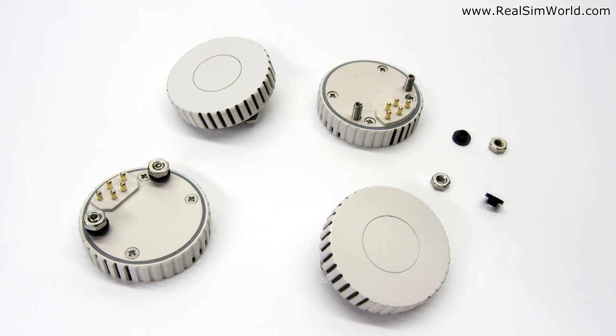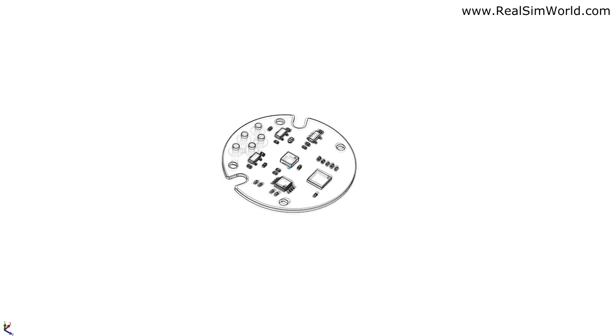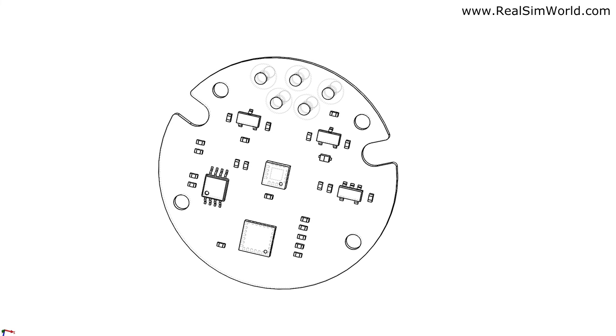You don't see this kind of stuff every day, they're not ordinary potentiometers. There's a delicate microcontroller system within each one of them. The center chip is a non-contact magnetic encoder and it doesn't wear out like a pot. It might be slightly sensitive to very strong ambient magnetic fields, but fortunately that's not found in most of your homes.